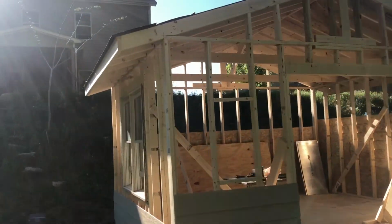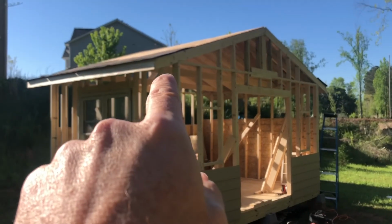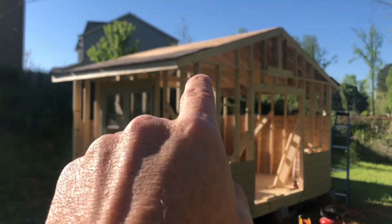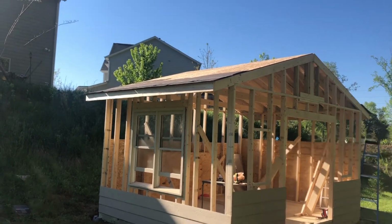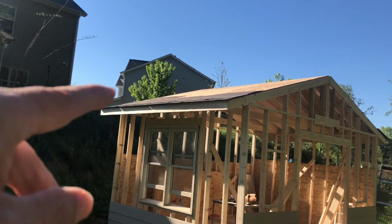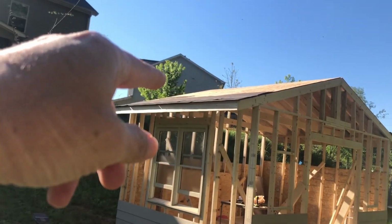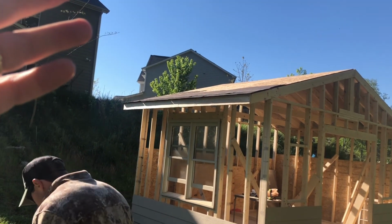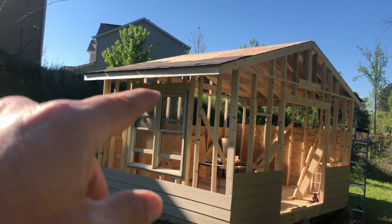Okay, so we finished up putting the plywood on the roof, the 1/2-inch plywood. There's 4x8 sheets. That's a 12-foot wide by 10-foot rafters. So we were able to just put in the 4x8 sheet, a second row, and then cut the one down the middle. It's 24 inches wide, which is a half sheet, saving sheets of plywood by keeping it to that size.